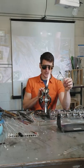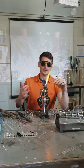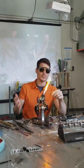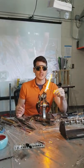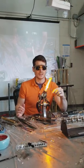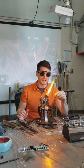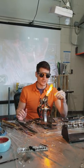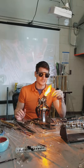I'm going to gather this back. Make sure you're oxidizing so you don't get any oxides depositing on the surface. Basically, if you stay oxidizing, as the molecules get excited they'll try to come up to the surface, but the oxidation, heat, and velocity will burn them off. It'll maintain the purity of the color without any striking or oxide deposit. You can see if you're running oxidizing enough by looking for that haze on the surface.